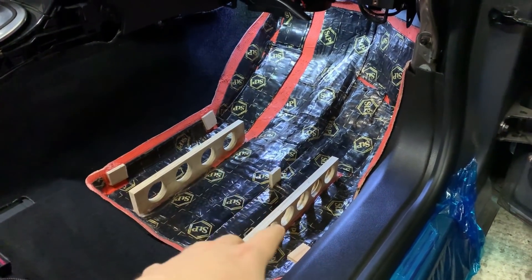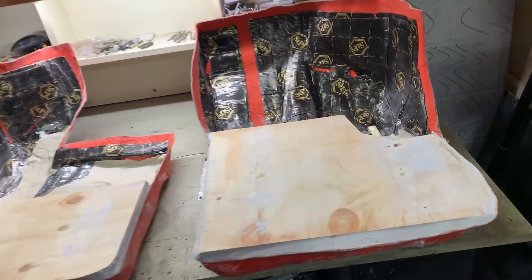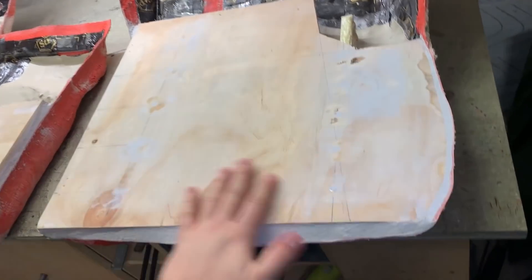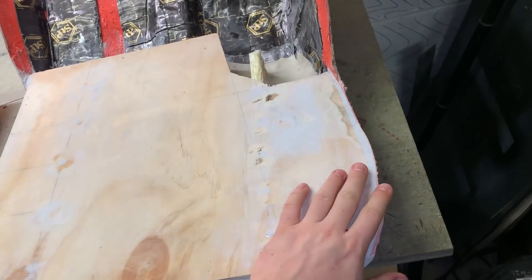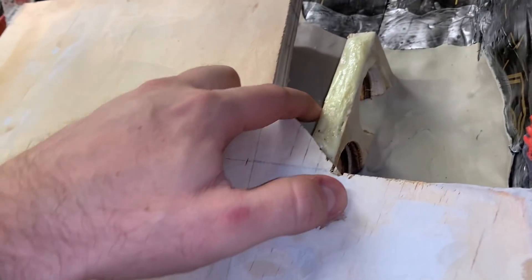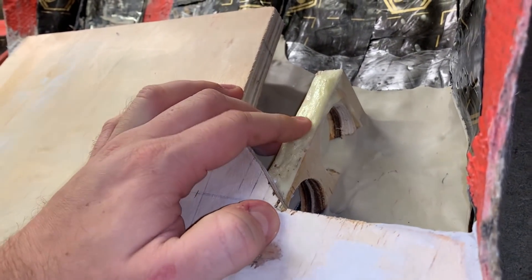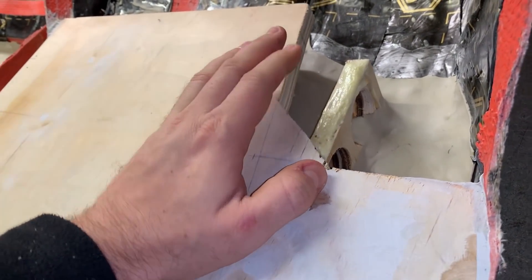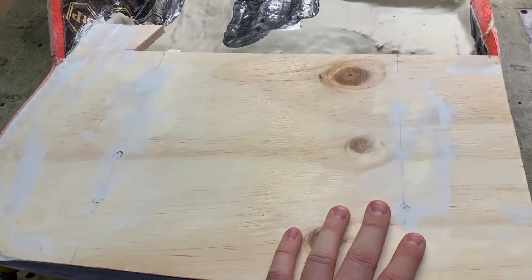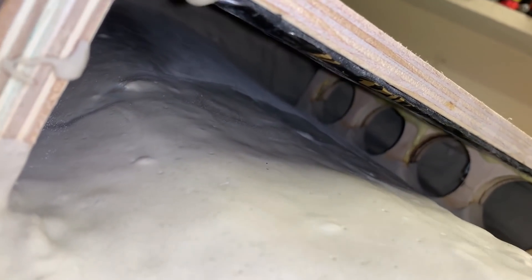The top plate is now bonded in — there's fiber filler all around bonded into the edges, screwed to the braces underneath, and glued with PU adhesive. I went a bit too far with the adhesive and you can see how much it expands. Someone told me in a previous video that PU wood adhesive is the worst idea ever — let's just leave it there — but it definitely fills the gaps and makes a stronger bond; the glue won't fail. It was also filled with milkshake, filling everything in — all the edges and all the gaps.